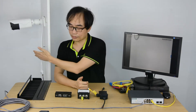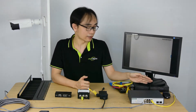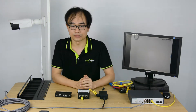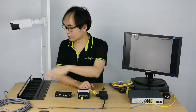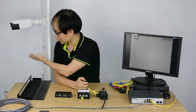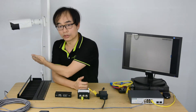So where should you add the surge protector — next to the camera or next to the switch? People told me they already have an AC surge protector protecting the power from the AC outlet, but it may not help. Imagine if the surge is picked up at the middle of the cable — it can travel either direction, whichever is closer to ground. Technically, we should add a surge protector at the camera and also close to the POE switch. At a minimum, I recommend installing a surge protector close to your camera, because you don't want to deal with the camera outside when something goes wrong.